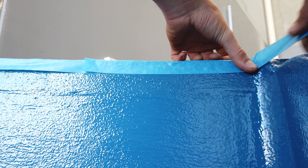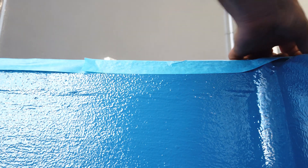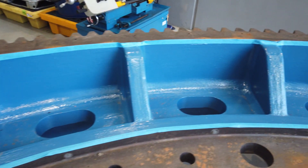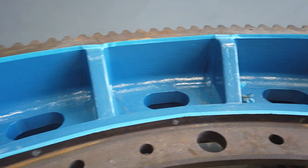The first order of the day is to protect the paint. To do that you can use blue masking tape or aluminium tape. Aluminium tape is better — it reflects up to 98% of infrared light. On this job we just used blue masking tape, and when the laser passes over it, it simply reflects off the surface.